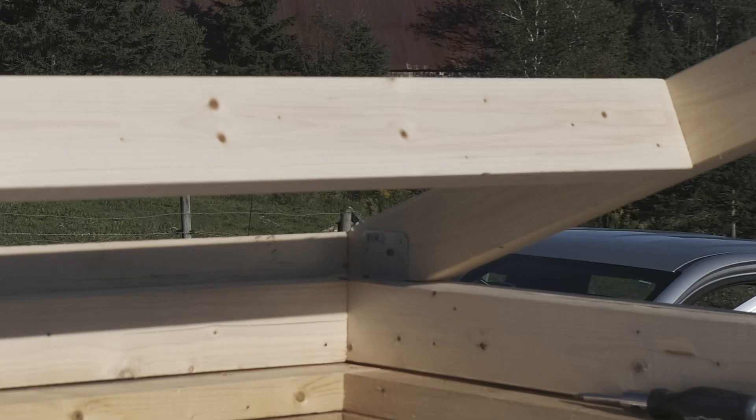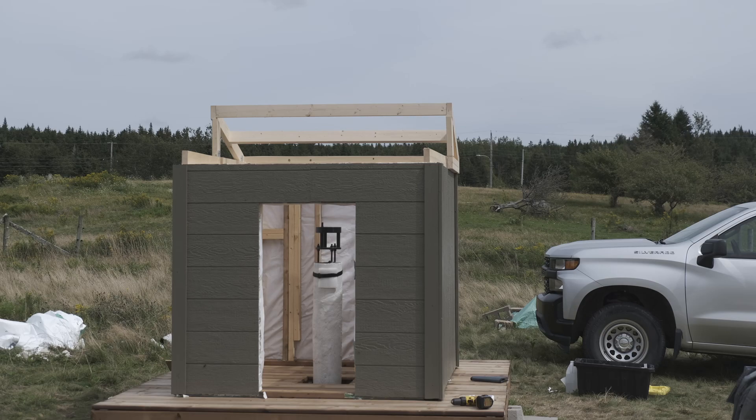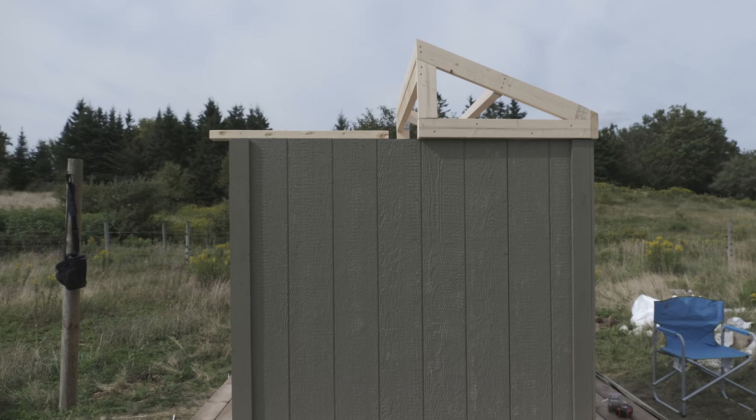That's a little extra complicated in my design, as I've bolted a 2x4 inner beam to a 2x6 outer beam to create extra strength, and fill the space where the rafters and sheathing will come down over the roof. With this very important part of construction, I made no exceptions with timber quality — each piece of wood had to be absolutely perfect, with a tight grain and no signs of cracks. It took a full day to get that one half of the roof done to my satisfaction.